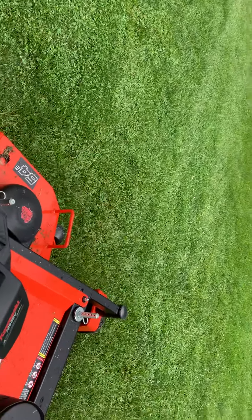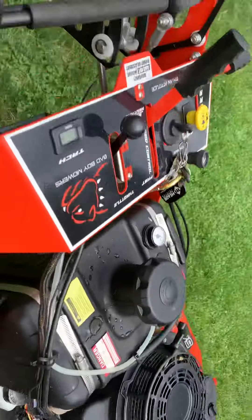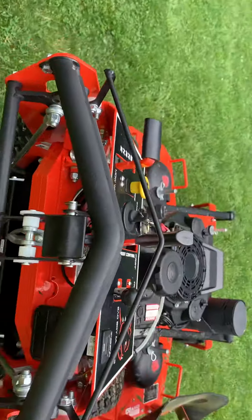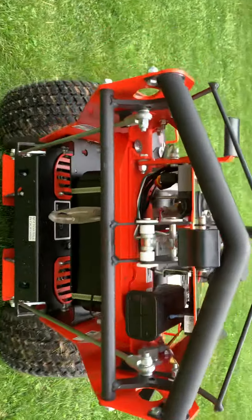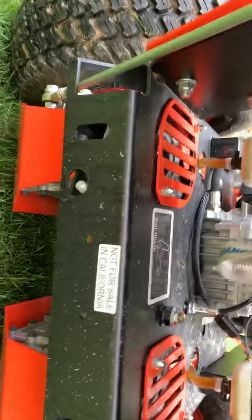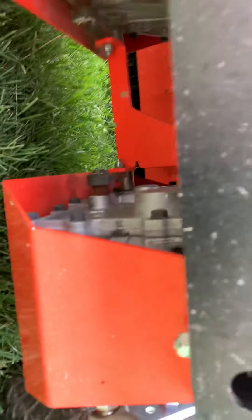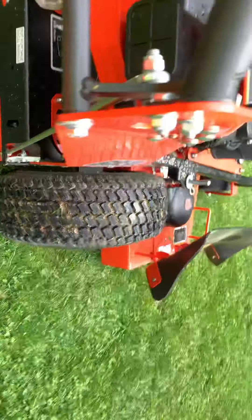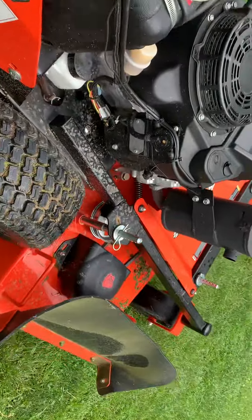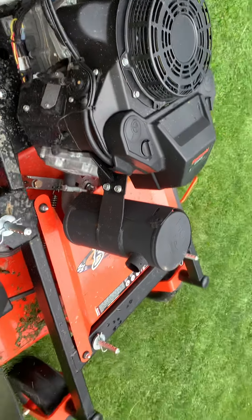Normally the people who sell them will be your local Kubota dealer — that's how it is in my area. I live in Northern Kentucky. Down here you have your hydro units — these are the Hydro Gear Z3100, which means they have a filter underneath them that you've got to change out about every 100 hours. You've also got to change your hydro fluid, which ensures longer life of your hydros and your transmissions.